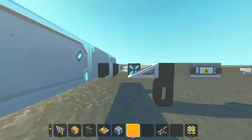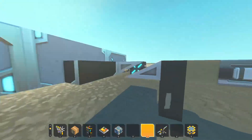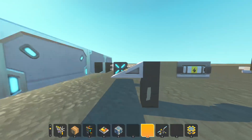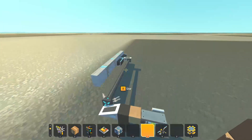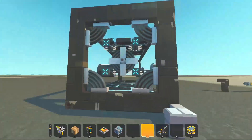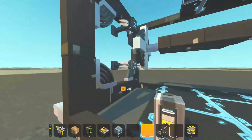The reason why we have these wedges here is so that these can slide through each other without colliding. This is a type of floating pass-through or non-collision pass-through, and that's the principle — to keep the cylinder from hitting its support.